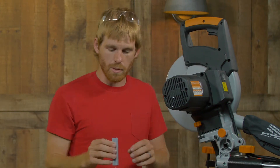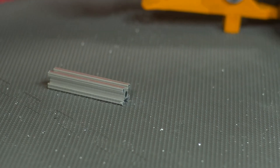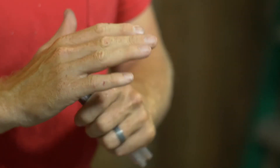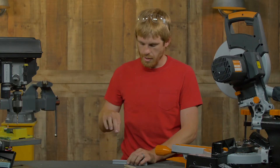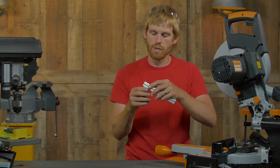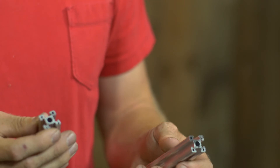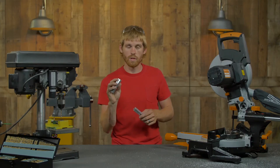You can see that with the right blade it cuts very easily and leaves two very clean ends, so they're both very usable pieces. If you wanted to, you can go ahead and tap this piece and screw on a plate or any Actobotics component to it. But we're going to move over and actually drill down through the side of the X-Rail in order to make a 90-degree joint. There are lots of different ways to make that 90-degree joint, but without any added components we're going to show you how to modify and put screws right through one piece into the tapped holes of another piece.